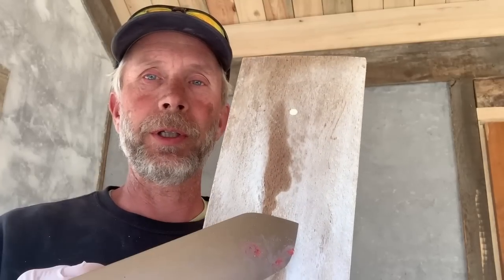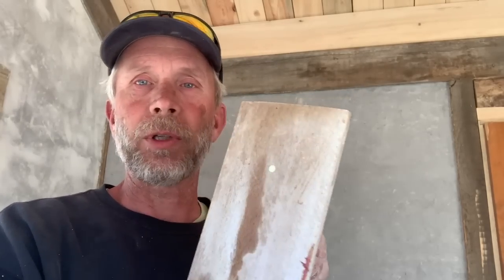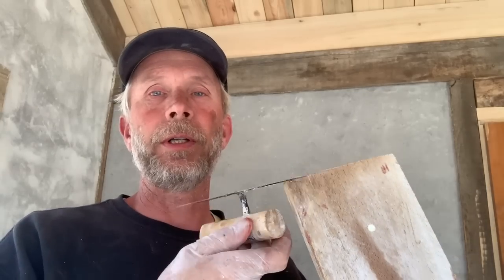So now I'm going to apply the red iron oxide pigmented lime putty to this plaster wall. I use a wooden trowel as a hawk because it's light, and I work on it such that I have a pile of fresh material here. I have a bit that I've scraped off my trowel that has some contaminant, some grit from the wall in it. And then I go back and I use that to fill edges because they're where grit comes from anyway. So I minimize that in the field by segregating that off here. And then here I have waste material that's just too gritty to work with. And then I leave this corner clear so that I can take my trowel and scrape off things from the outside edge, because they'll start getting in my way and dragging into the work. So it's kind of meticulous, but it's the system I've adapted.